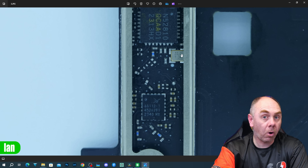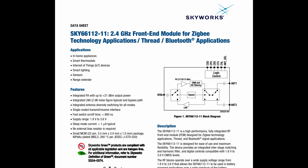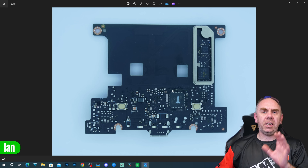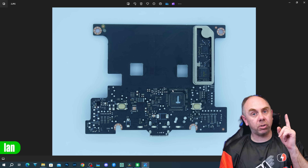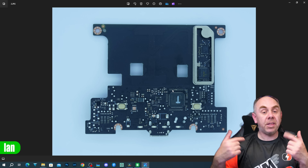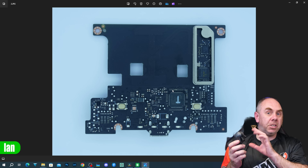That has a little clock down there. Moving down, we've got our power amplifier — that is from Skyworks. You can see the Skyworks logo there: the 66112-11. You can see the antenna tracks heading off, coming into that one there, going off to a via through to the other side of the board. The big difference in this remote is there's no OcuSync, which means there's no need for a heatsink, it's going to use less power, hence only one battery. DJI have been able to slim down the components in the remote. No more customized chipsets — that's largely what's driven the cost reduction.